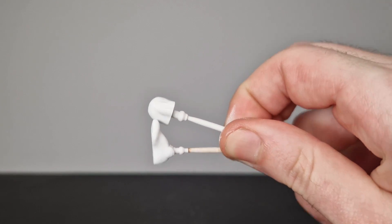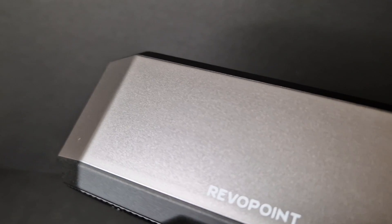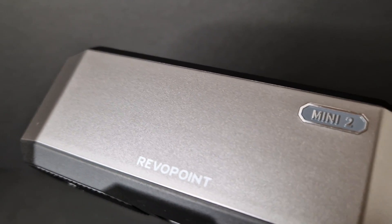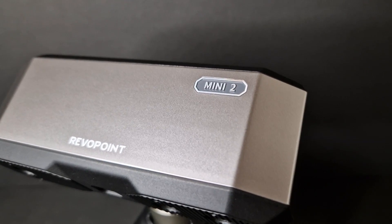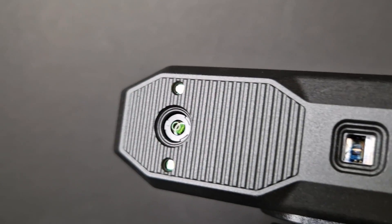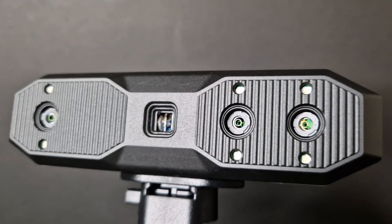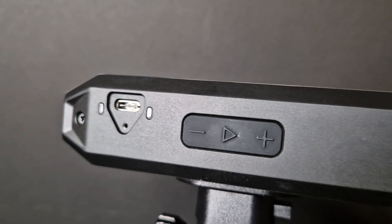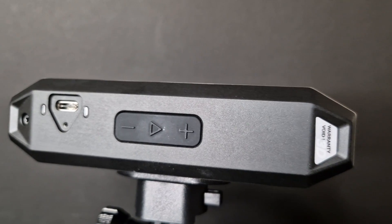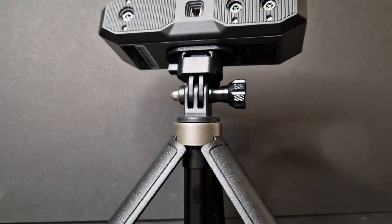You can also see I've attached them to toothpicks just to put them on the rotating base to scan. This is the scanner we're going to be using — the Revopoint Mini 2 — and this thing is incredible. It has the ability to capture a small object's intricate detail with precision of up to 0.02mm and a single frame accuracy of 0.05. It also has a 16fps capture speed, allowing 3D models to be created really quickly with up to 8 million points captured per second.